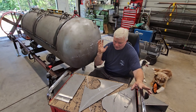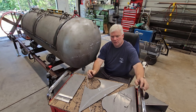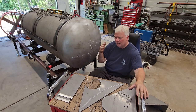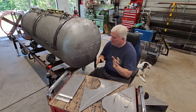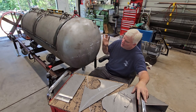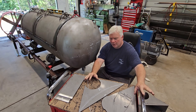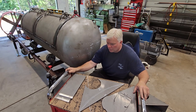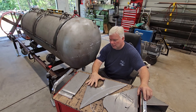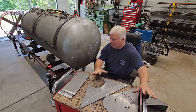I've been wanting to do a collector kit for a long time, but couldn't think of a really good way to join the parts that guys could do on the work table — get them tacked up and then attach them to the tank — a lot like we do in the firebox joinery video, where we tack it to the tank, use a marker to mark our rectangle out, stick it up there, get all the marks done, cut the hole, and then slide it in. That's exactly what I've always wanted to do with a collector kit, but couldn't quite figure out how to get the joinery, the geometry, and all that right. It turned out to be a lot more complex than I originally thought, but I finally got it done. This is my latest version of the collector kit, and what we're going to do now is put it together and mount it to the tank.